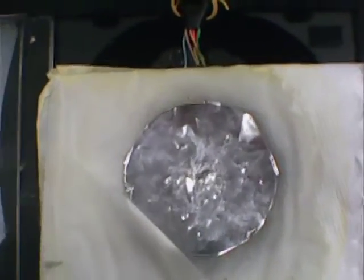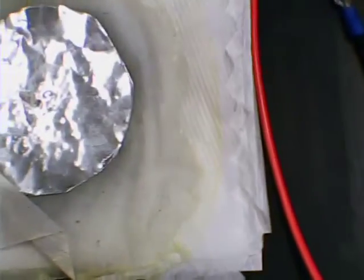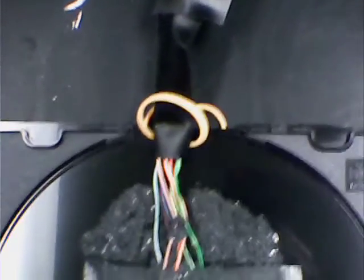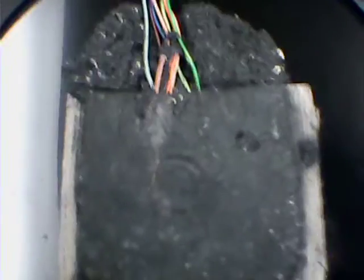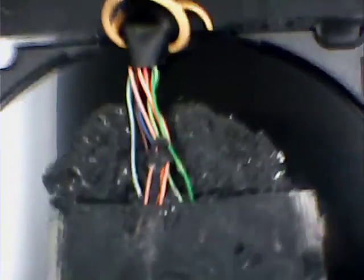For this setup, I use an empty CD case and a circle cutter to cut out a circle of aluminum from the baking pan. I've got paper toweling under it as an insulator, then another section of paper towel, and there's the active anode. I've got 26-gauge copper wire from telephone or cable line — I bare the copper wire and spread it out in there as a current collector. And you should see a tea bag, which has the activated carbon, manganese dioxide, and magnesium hydroxide. Some of the material came out of the tea bag. You can get reusable tea bags on eBay — I'm going to pick some up. That is all wet with the sodium hydroxide.